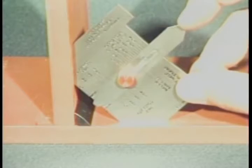Again, place the 45-degree bevel of the gauge against the adjoining plate surfaces to measure the permissible fillet weld convexity. Lower the slide to the weld throat and read the maximum convexity from this scale.